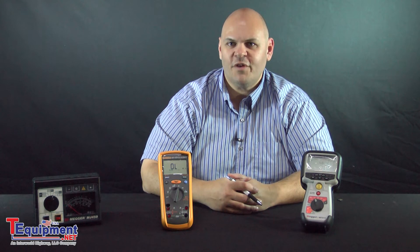When you're doing an insulation test you can either do a spot test, which will put a voltage through the wire and take the resistance measurement right away, or you can do a decay test, which will look at voltage over a specific amount of time. You can also measure how strong the wire is by doing what's called a polarization index test, which takes the voltage and redoes resistance measurements over a fixed amount of time.